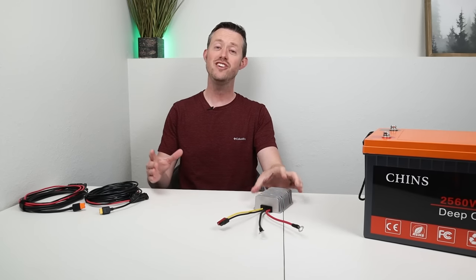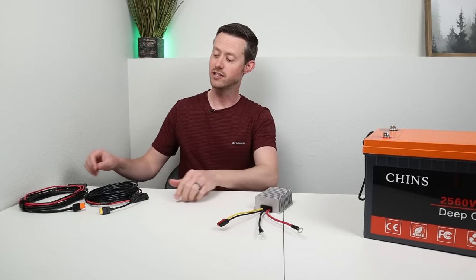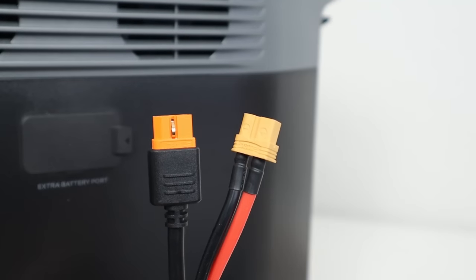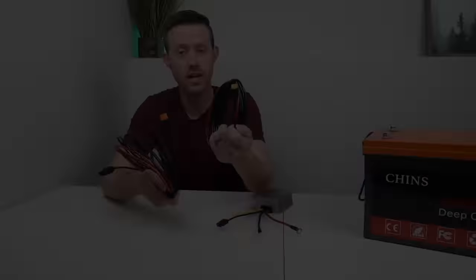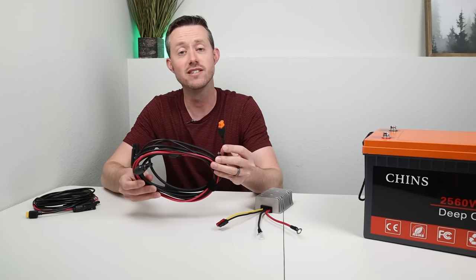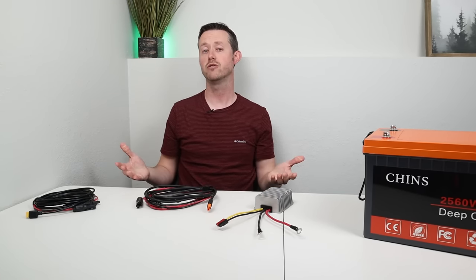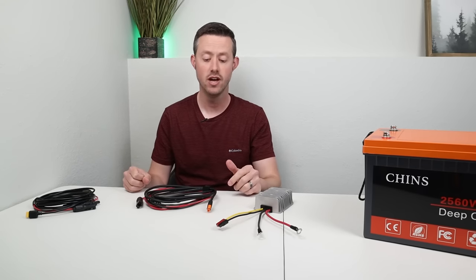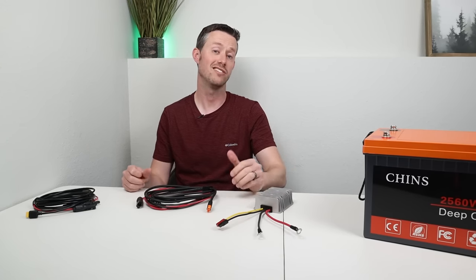Some of you may be wondering: how did we get over 300 watts on both the EcoFlow power stations using this boost converter? Well, there's a secret here that's not well known. EcoFlow makes two different XT60 charging adapters — you have the XT60 with the orange tip with a metal pin on it, and then you have the XT60 that's yellow. In all the testing today I used the XT60 with the metal pin, and what this does is it tricks the power station into allowing the full amperage input. So if you have an EcoFlow power station and you want to get maximum input, you can use this charging adapter to get peak power from basically any boost converter.